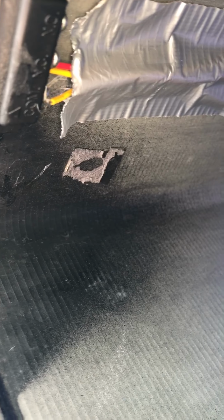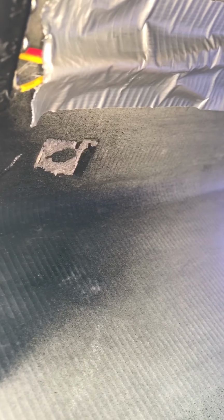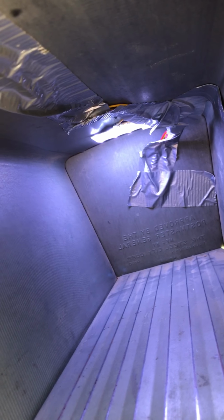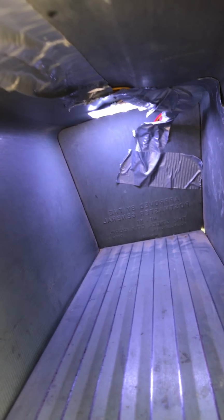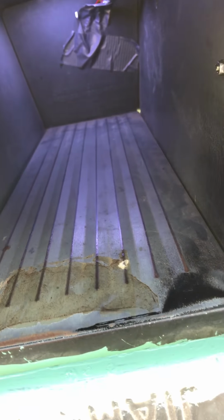We'll fix that. Anyway, the LED array I ripped off of it. Inside here is the reed switch, common, and the normally closed. There are two wires coming from the normally closed. One goes to the LED array, so when the door opens, it applies voltage to that. The other goes back to the wake up pin on the Photon, which is in the step light back there, to wake it up and send the notification. When you close it, the light goes out.